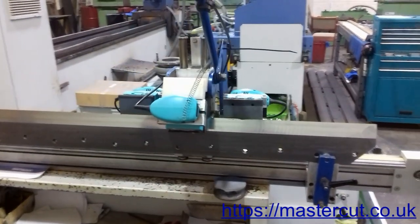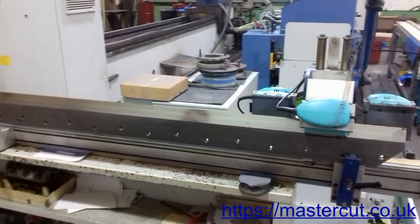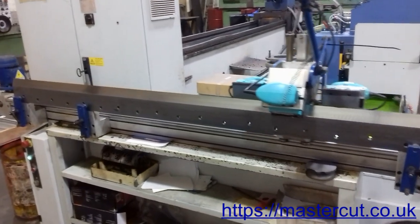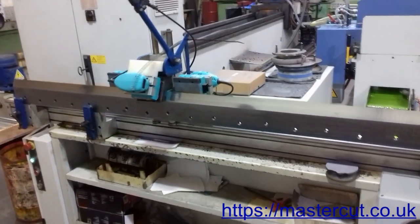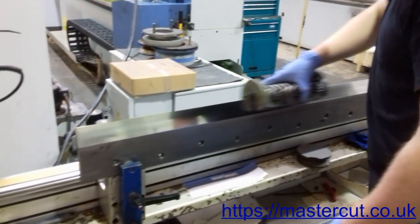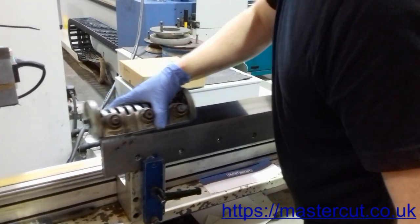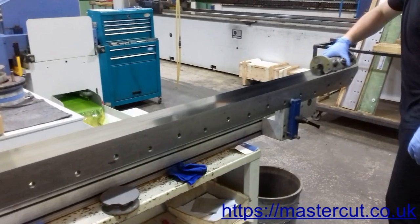The cutting edge of a blade is very thin, and when it is slightly pushed off to one side, the blade can feel dull, even though it is sharp. To improve the geometry and texture of a surface, we hone the cutting edges of a guillotine blade. To do this, we use a honing machine with five very fine grinding wheels. Honing a blade means polishing that edge.